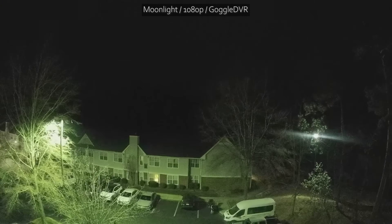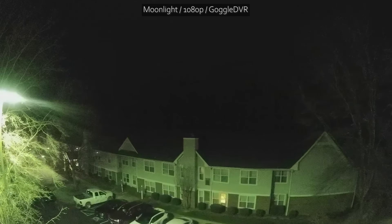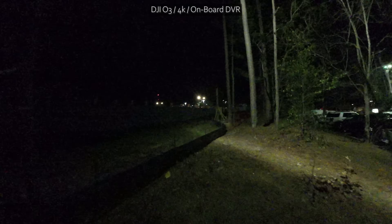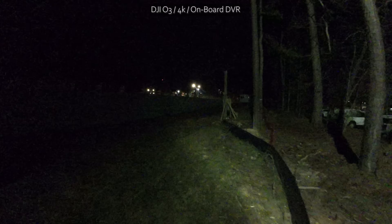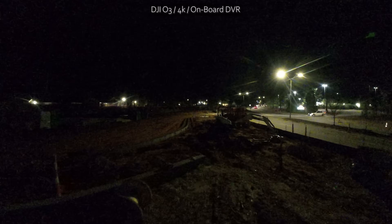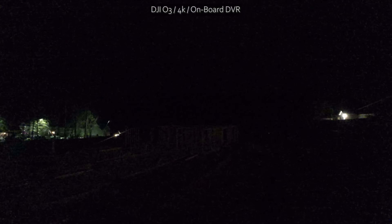This is the area where the Moonlight is probably at its weakest compared to something like the Pro camera. But how does it stack up to the O3? The answer is that it absolutely kicks the snot out of the O3, which is kind of expected — the DJI O3 has never excelled at low-light performance. With the O3 at max ISO and max settings, this is what you get. It's worse than the Moonlight. I was able to very carefully limp through, but couldn't get to the back or any of the darker areas at all. The Moonlight is definitively better than the O3 in terms of low-light performance. The flip side is that the O3's image is pretty clean — DJI seems to be prioritizing image quality whereas Moonlight is prioritizing low-light sensitivity.